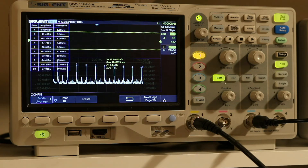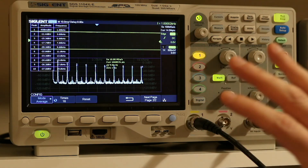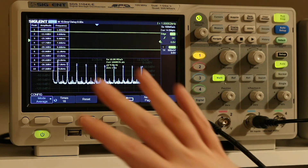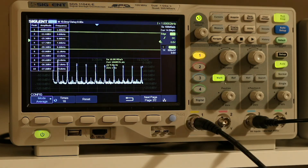Of course, if you have an audio interface and a computer you can do all that stuff on a computer — you don't need a scope to do it. But that's really more for completed modules and completed devices where you do those total integrated measurements. The scope allows you to do it at the individual component level, at the circuit level, while you're experimenting and working on stuff. My older scope has an FFT but it's basically useless — it'll display it but doesn't really tell you anything, whereas this has enough information to be really useful.